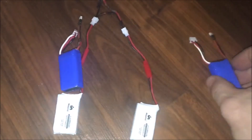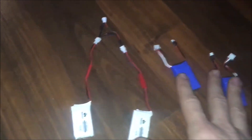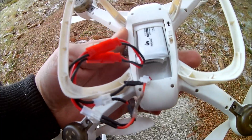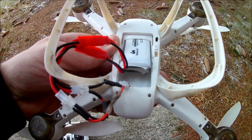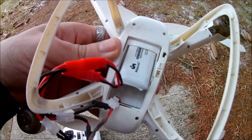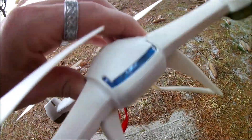The real concern comes when I connect these up here to make a 4-cell, but we're not going to test that right now. We're going to test these — brand new batteries, same company, same name, same voltage. DM009 test dummy. We have both batteries in there, which are 3.7V 850mAh each. We've increased the voltage to 7.4V — 8.2V fully charged — and they're still 850 milliamp-hours, so we have a bit higher capacity and higher volts.